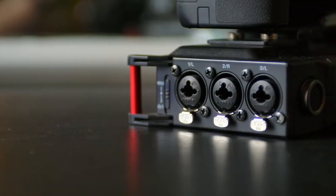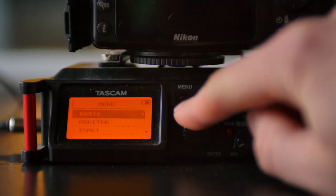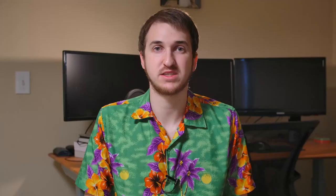This is great if you're working with a single microphone, but what if you want to make use of the four total inputs that you have on this Tascam? Well, unfortunately you're not going to be able to use all four, but you can still use two of the outputs. To do that, we're going to go into our basic settings, make sure that we have our two microphones enabled that we're wanting to use, and we're just going to pan one of these all the way to the left and one of them all the way to the right. The Tascam is going to be outputting a stereo signal to the camera that has the audio channel of one microphone on the left stereo channel, and one channel of audio from the other microphone on the right audio channel. If you need to get these separated out so you can have two usable sources of audio, I have another video on that — check that one out on my channel.